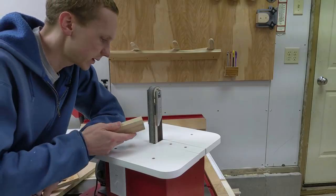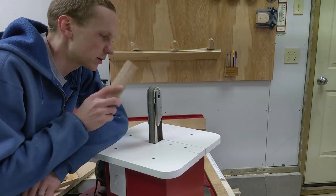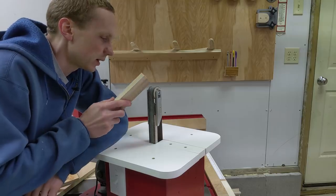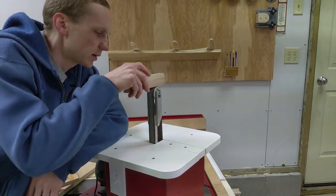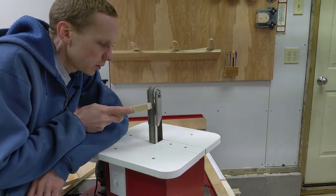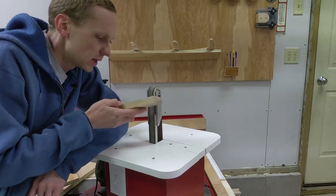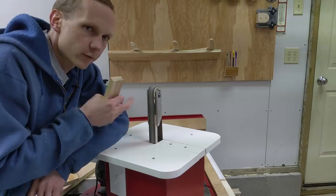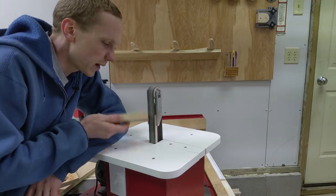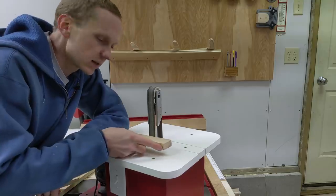Another thing I like about this sander are the three different sanding spots on the belt. Most commercial sanders enclose the top wheel for safety reasons but I left this one open, which allows you to sand right on the wheel to get a nice contour on a curve. Right below it is a soft spot because there's no platen behind there, and that helps you break edges and gives nice soft control. Then down below there's about three inches of platen that allows you to do either inside radiuses or sanding to straight lines.